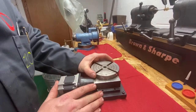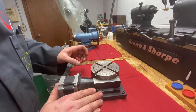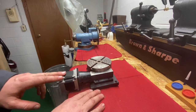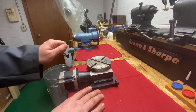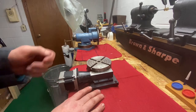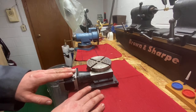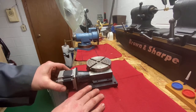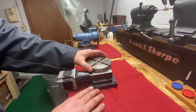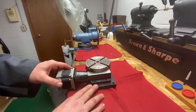On the next indexer we have here — or dividing head — we get into something a little more modern. This is actually a motorized one and goes with the little CNC mill that I have. This one is pretty much the same as all the ones we've seen in indirect indexing, except instead of having a dividing plate, sector arms, and a crank going through different holes, it uses a stepper motor. The stepper motor divides everything up into fine increments in the same way — I can't remember what the resolution is of this stepper motor, but it divides it up into fine increments. This is a much more modern method of how they do it with CNCs now.